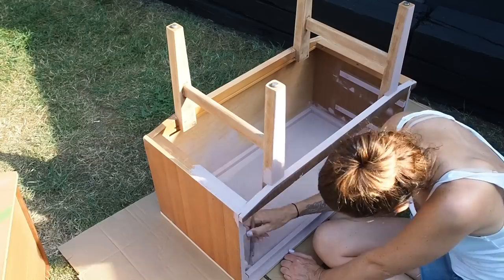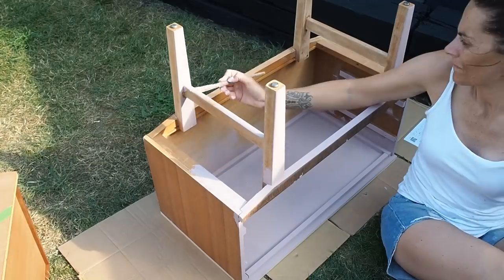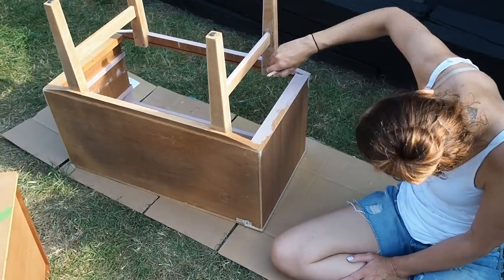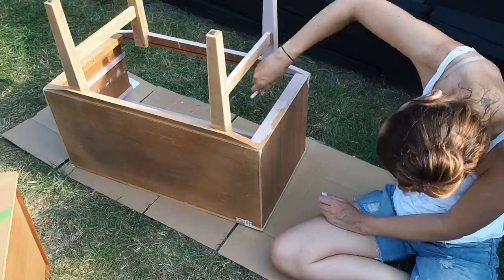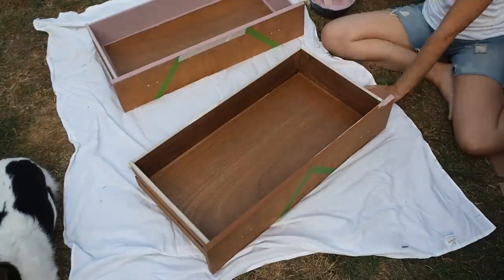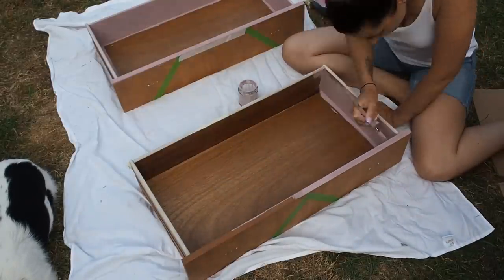Some areas I painted with a brush especially tight little corners, and some I painted with a foam roller. The key to painting furniture is really nice thin coats so you don't get any drips, bubbles, or bumpy bits — the foam roller does this really well but things like the legs you have to paint with a little brush. I'm going to sand in between every coat because I really do want this paint finish to be smooth and beautiful. Total number of coats is probably going to be two as this paint has really good coverage, though on the sides I may do a third.